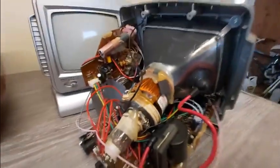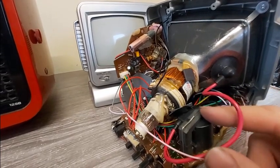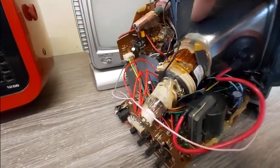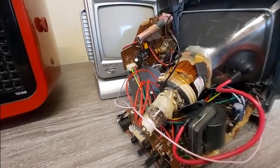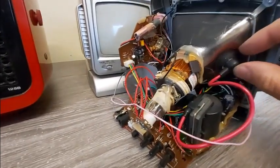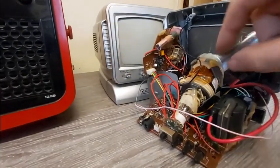There's a lot of voltage going through this — this is the high voltage transformer, or line output transformer, going straight to the anode cup. In color TVs these are usually on the top, although I have seen color TVs where it's on the bottom. A little bit of safety: you should not be doing what I'm doing now without care, because you can get a nasty jolt even when the TV hasn't been powered up for quite some time.